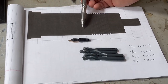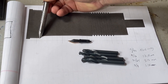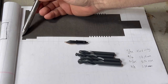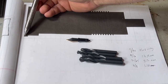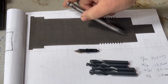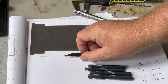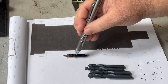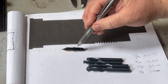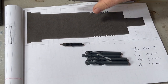Some things that are important to note when making a section: if you don't drill these little reliefs, your threads will stop too soon or too late. If you drilled this all the way down and just made it one big cut, your nib housing would move in the section back and forth. What we're doing is replicating the shape so that when this goes in, it's a nice snug fit with no movement of the housing side to side — that will make it really comfortable and easy to write with.